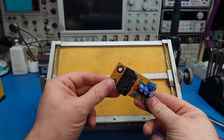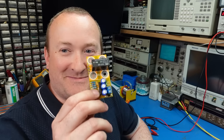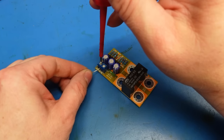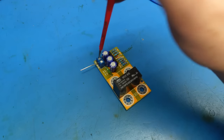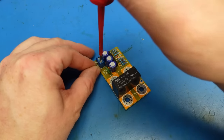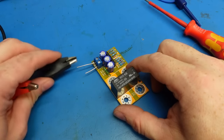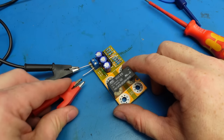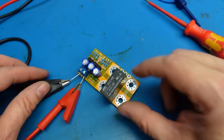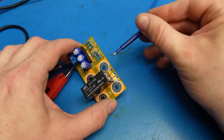Well, that's about it. There we are - pretty much finished. It would be a good idea to test this before I fit it in the amp. I'm just going to screw in a couple of little bits of wire so I can clamp onto these a bit easier. So that one would be the ground side, although this is AC going in. It's half-wave rectified and doesn't actually use AC, so I'm going to go with just the bench power supply DC. The relay is 24 volts, so that's a good indication of what we need. Just going to check one channel at a time.